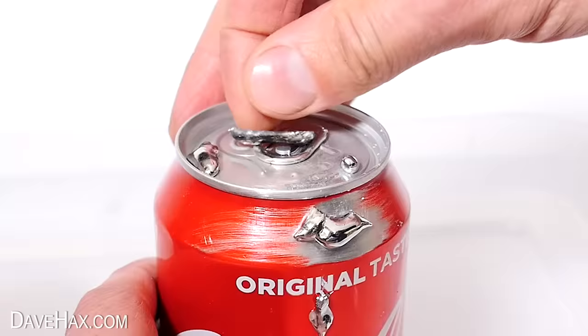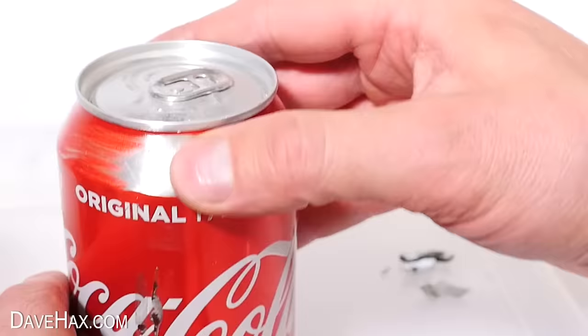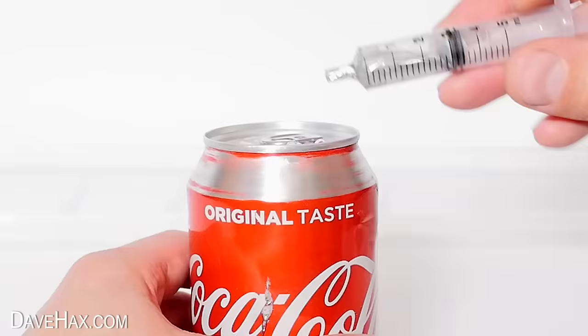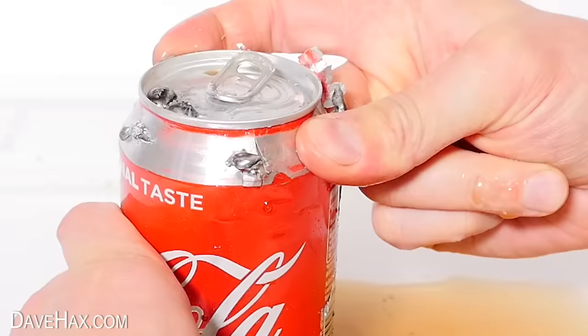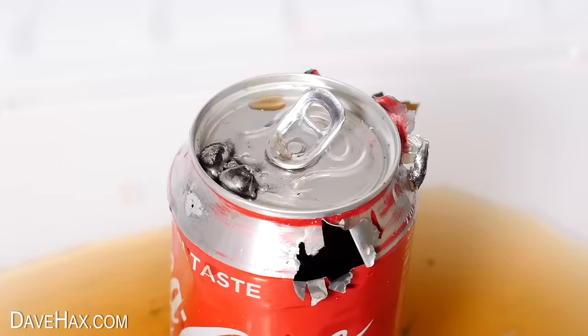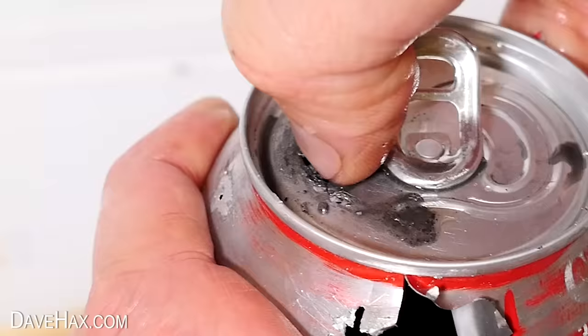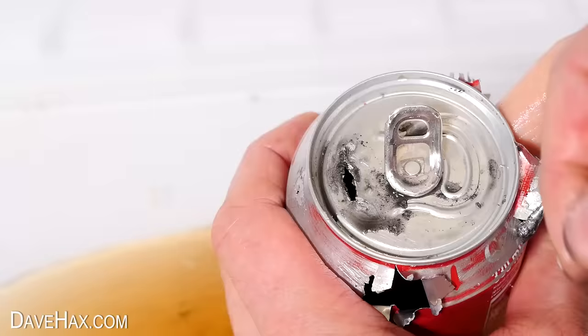Despite the gallium having punctured this can immediately, the top is still solid and so is the side. So I decided to sand off some more of the paint and try again. This time, after I left it, the side had become weak in this area on the back and also this little patch on the front, but it didn't really spread more than that. It does look amazing though. The top of the can still seems pretty unaffected. I removed this piece of gallium and scratched away a little. You can see a little hole where it compromised the can at the beginning, but for some reason it didn't affect the whole top section this time.